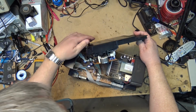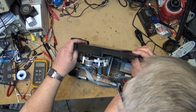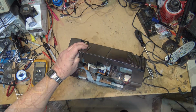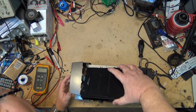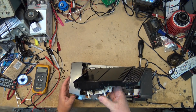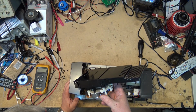And it's connected by means of a couple of cables down to the main chassis. And I'm just looking to see if there's any belts broken on this thing. Let's take a closer look here. The loaded cassette here, and just see what happens when I push play. See if the capstan shaft is trying to turn. Well, the capstan's turning.